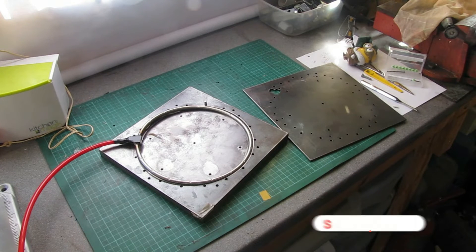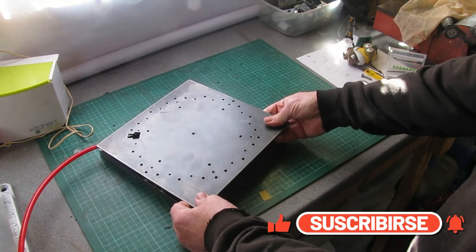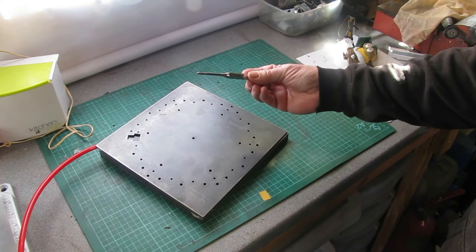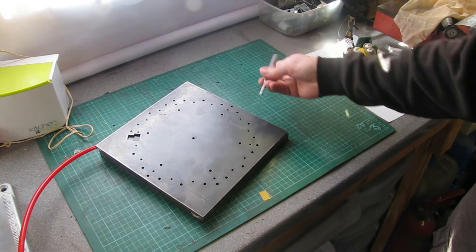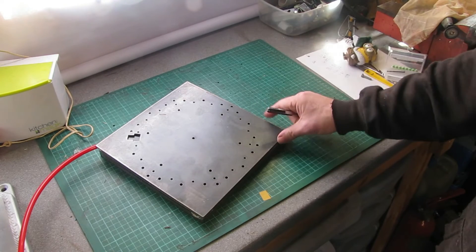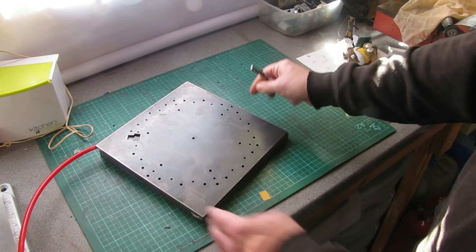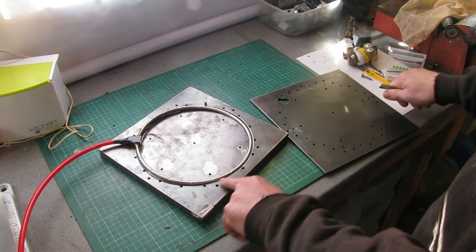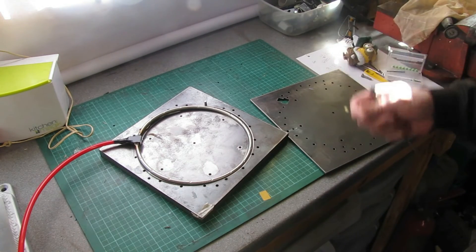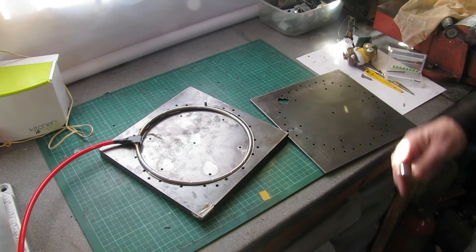To mark out where the holes need to go, I use a mask which sits over, and then I've got here a 4mm punch which I've ground to a point. As you'll see there's all these holes — I've got two of these that stack up on top of each other, so you've got like an 8mm pilot hole as a guide. Give it a good whack and you end up with these indentations. I find them better for when we silver solder the syringes in — it's nice that you get a little well where the silver solder sits.